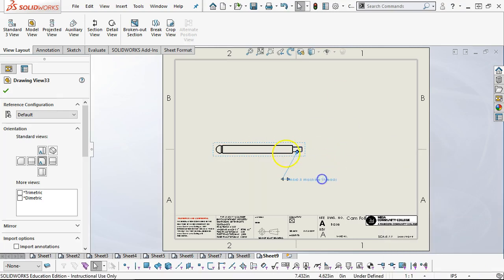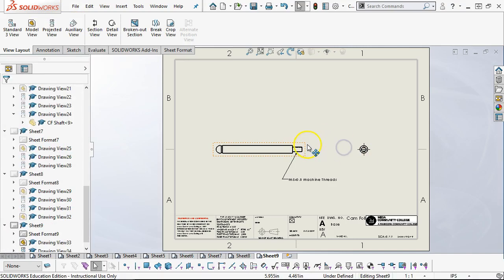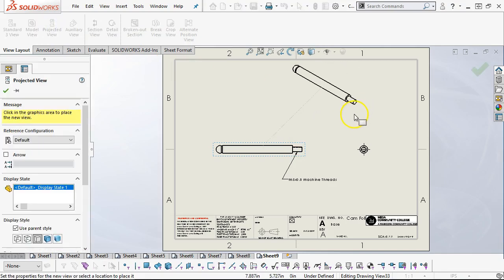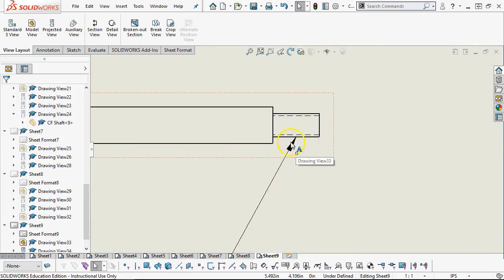And then the other issue is this rides up and down that cam, and it kind of shifts position, changes the location. We have the potential, let me finish my projected view here, we have the potential for another stress riser right at the end of the threads. Right, I didn't put a relief in this one. It's basically assumed going right up to the face.